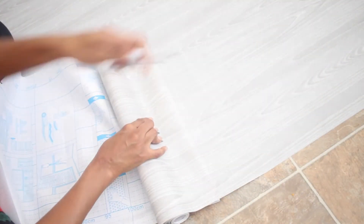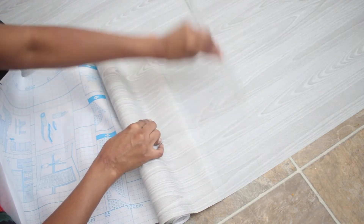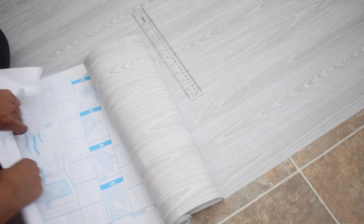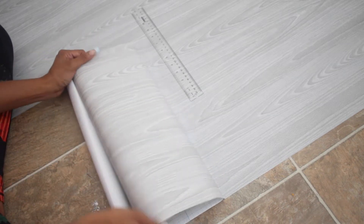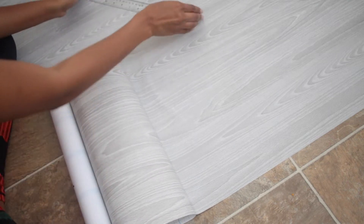All you do here is just pull down a little bit, smooth it out, pull down a little bit, smooth it out. That way you avoid any types of air bubbles, and it just prevents your contact paper and your flooring from looking unprofessional or janky. I just pull a little bit of the backing down, smooth it out with the ruler. Because the paper is cheap, sometimes I smoothed it down a little too hard and it kind of ripped the paper, so I had to trial and error how hard to press down with the ruler.